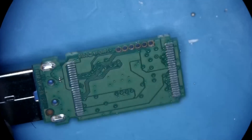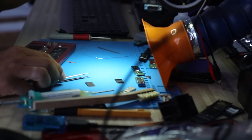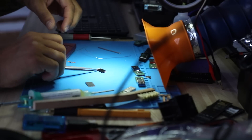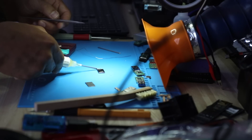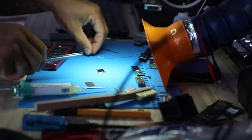We should have been seeing the same recognition when the memory was removed from our patient unit. If it's not communicating, there is an issue. So I'm going to turn this off, and what we're going to have to do is prepare our memory chip for the socket. This is the beauty about this socket — it makes it so easy and fast to perform all this work. You don't even have to solder it back on.